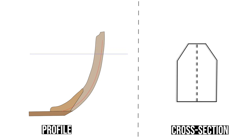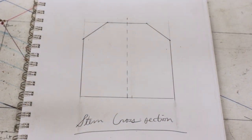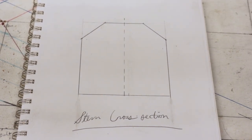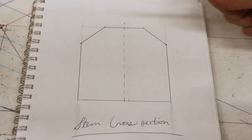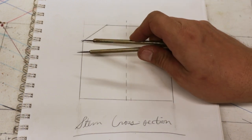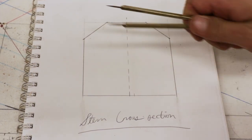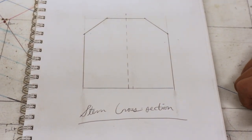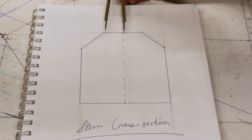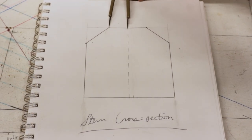The changing bevel is ultimately dictated by the thickness of the planking and the angle at which the planks are hitting the stem. What we have here is a cross-section of the stem at a given waterline, and we need to figure out what the depth of the bevel is going to be. What we already know from the bearding line is how far back the back edge of the bevel is. Additionally, we know the angle of the bevel from the lofting board — we can pick this up with a bevel gauge. What we need to know is the distance from the center line to the front edge of the bevel.